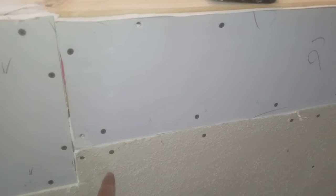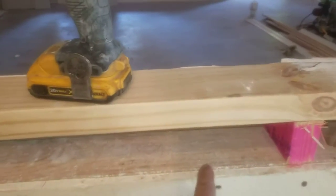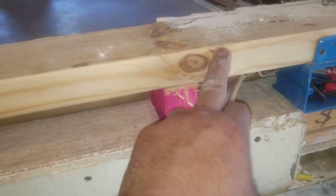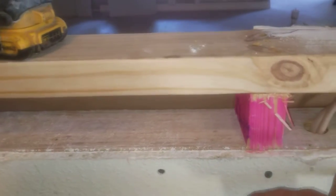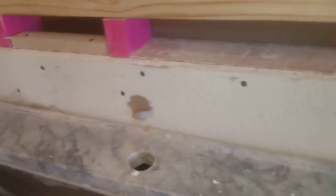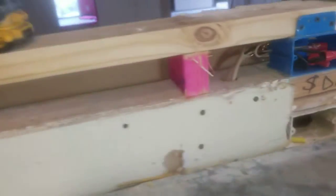That turned out with about inch-and-three-quarter on each side. On this side, instead of putting wood behind the gap where we raised it three and a half inches to make room for the electric going up, you could use a Dremel or fine tool and cut three-quarter inch all the way across — but is it really worth the four bucks you're saving?